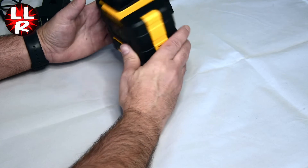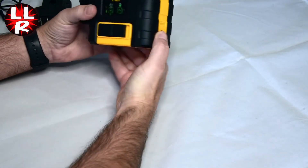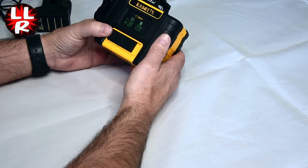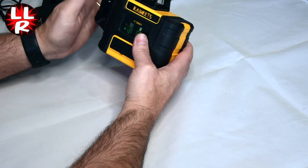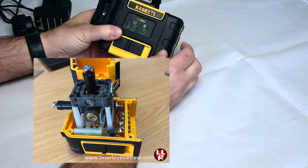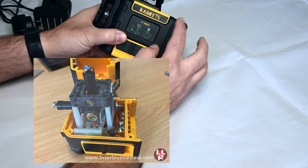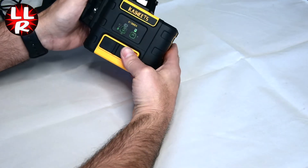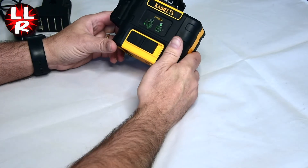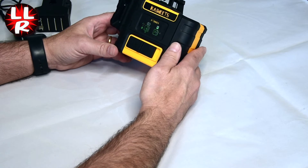I've checked the calibration on this and it's well within their tolerances. With a lot of lasers in this price point, there's no external access to recalibrate — so if it needs recalibrating after a drop or over time, you need to take it apart. As a calibrator myself, I prefer to just undo a screw to get to the calibration. That said, this is better than many in that it's not hard to break down and get to the calibration area — still quite quick and easy, and much better than some power tool brand lasers that are very hard to calibrate.